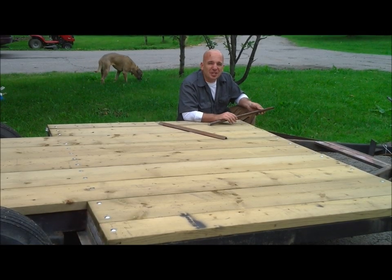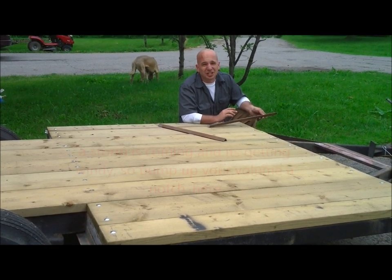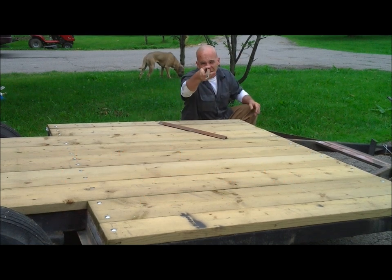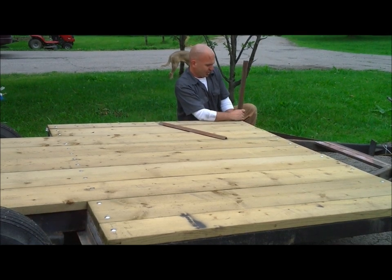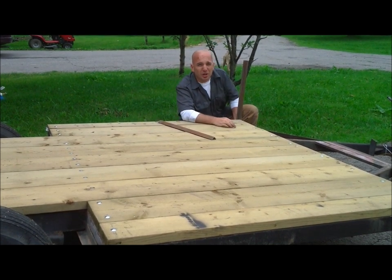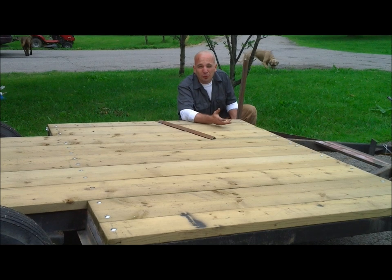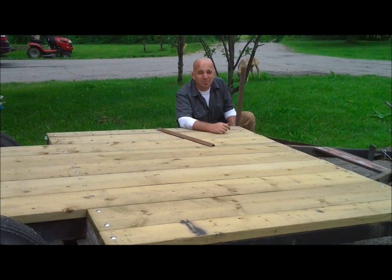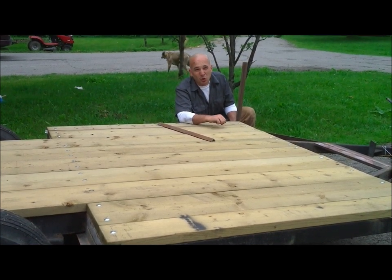The scouting trip went pretty well. Managed to find a bed frame somebody left out by the curb — you see them all the time when people upgrade their kids' beds and throw the entire frame out. It's perfectly good mild steel. What we have is inch-and-a-half by inch-and-a-half angle iron. These are going to be used for the trailer's bed stakes — the vertical members, the uprights — they get welded to the side of the bed, and then you run your rail along the top and box it in. We're going to do that with our MIG welder. These are useful because often you're carrying a big load — whether it be a four-wheeler, a skidoo, or bags of garbage — you need to tie stuff down and keep it from falling out on the highway. We can get these things welded up in short order if the weather holds.